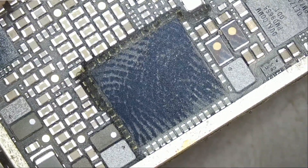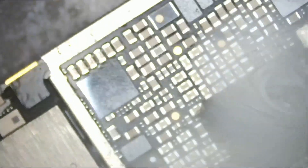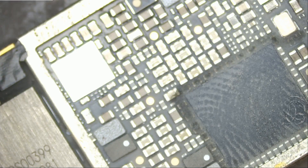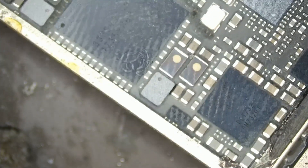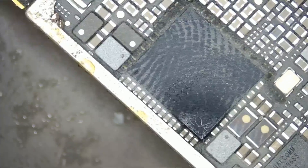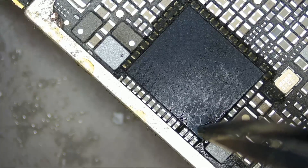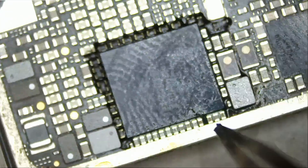I accidentally put my finger over the rosin flux — let's apply it again. I'm going to plug and unplug quickly; I do not want to keep it plugged in because eventually everything will melt and we won't know which component is causing the short. One, two, and three. See? The short is starting from the very edge, right over here. The board is still on because the battery is still connected, but we know the short is coming from right over here — from within the chip itself.